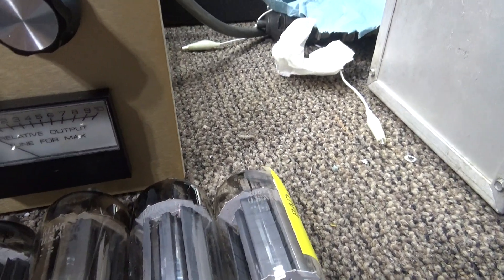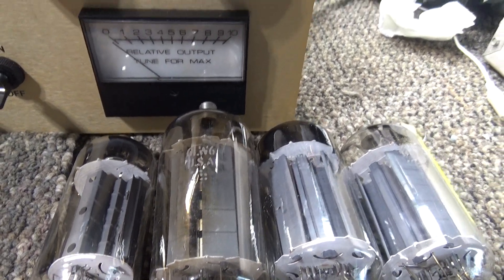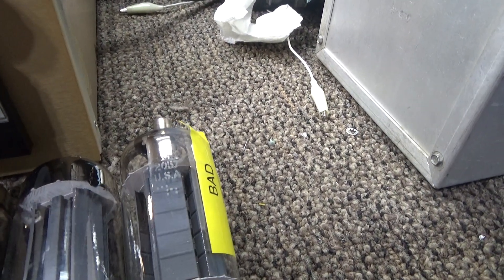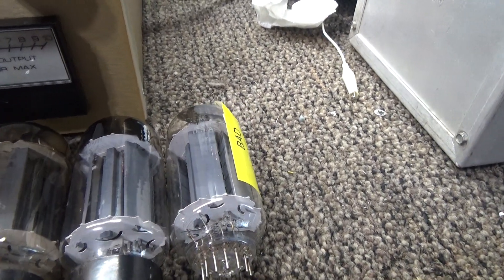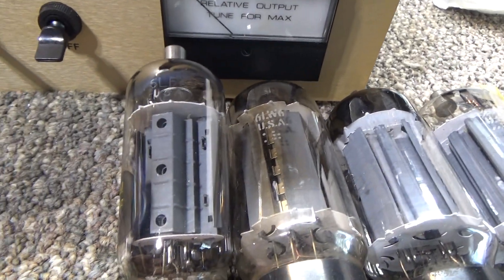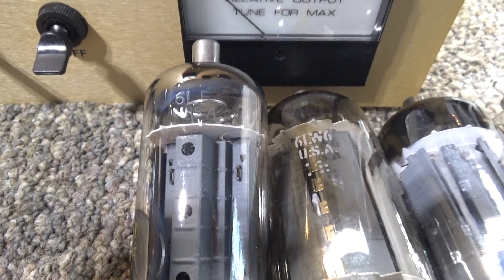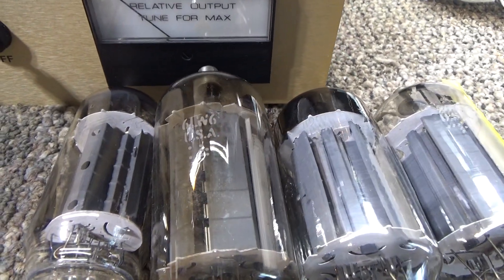The 8908 is a 40-watt tube and it was a variant of the 6LW6, which is also a 40-watt tube. They also made a Mako M2057, which is the same tube — a 40-watt tube — but the pinout and the bases are different. This here is just your average normal 6LF6 tube, which is a 30-watt tube, while the 8908 and its variants are 40-watt tubes.